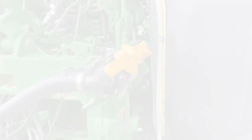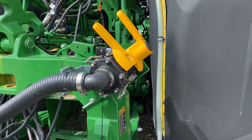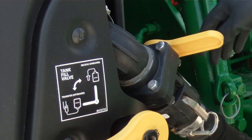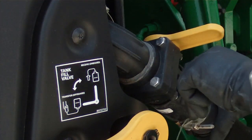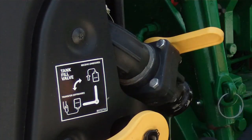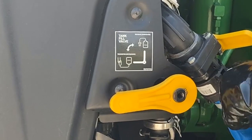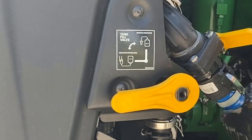Solution can also be transferred to a tender tank by doing the following. Begin by closing both the implement coupler and the outlet shutoff valves. Disconnect the hose coupler at the outlet shutoff valve supplying the implement coupler. Drain residual fluid in the line into a container approved for chemicals. Connect a return line between the coupler on the outlet shutoff valve and the tender tank or approved container.